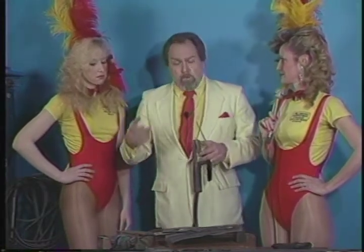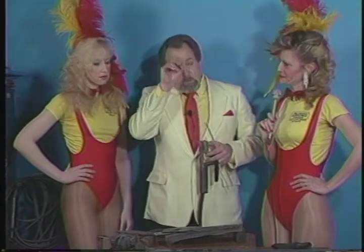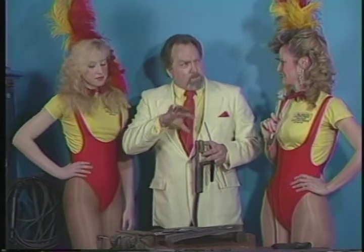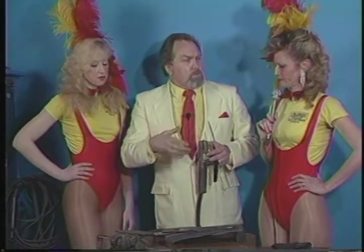Now, there are people that say the 110 welders have become more sophisticated. It's possible, I don't know it though. So my recommendation is about a 225, 230 amp, 220 volt stick welder. It works very well for a lot of different purposes, and they're very cheap.